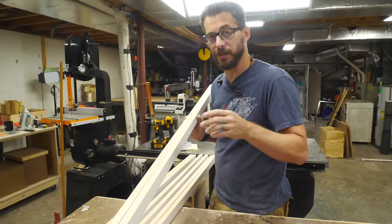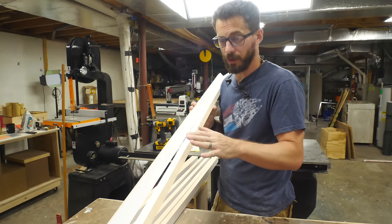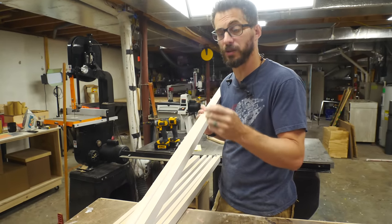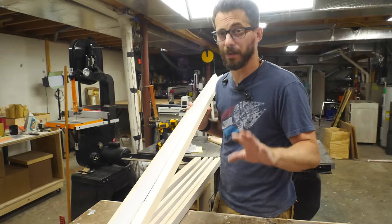The kit we got is expecting doors between one and one and three-eighths inches. Another problem is that these are pre-primed and gluing them together wouldn't work very well. So we're going to solve both of those things at the same time — run these through the table saw to rip them down to the right thickness, and that will expose the wood so we can get a nice glue up. You could also do this on a planer if you wanted to.